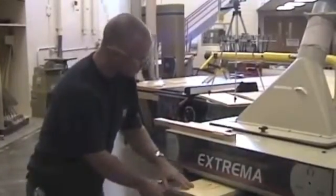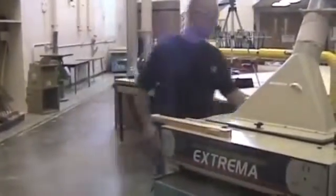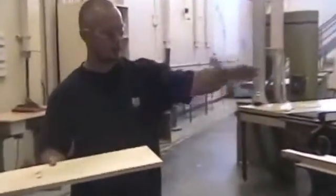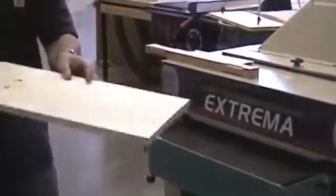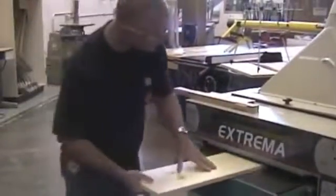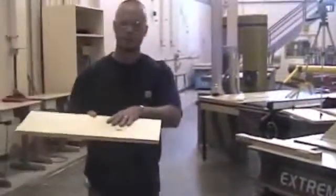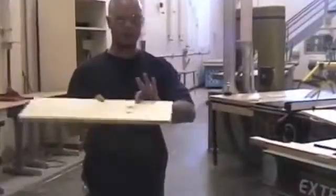You want to put the worst face up. Because it has a helical shaped head. That's normal. Up, I'm at my 5/8. I look at my board again. What's the worst face now? Well, it's probably this one, so I'll send this through. That's my first step in building my blanking box, is planing my material thickness.